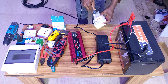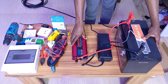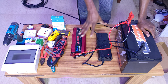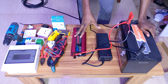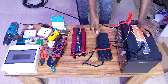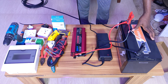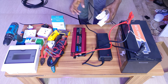Now we can charge the battery by plugging into the grid input — you can see it turns on and charges the battery. You can put this in a corner of your house and use it like this. One important thing to understand: when you connect and you're charging the battery while also using it, there is no grid bypass. If the load exceeds what you are charging with, you will be draining your battery. This is just a backup system — charge it, and when the battery is full, disconnect and use it when you don't have grid power.